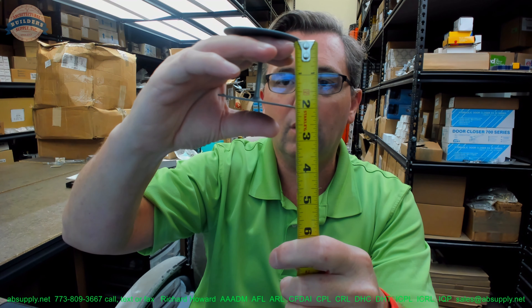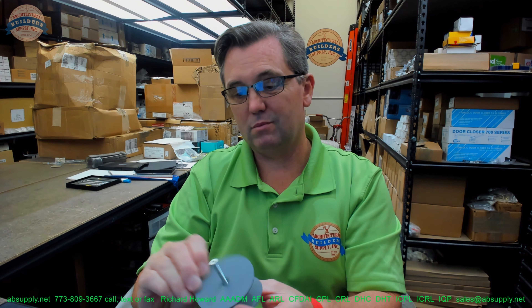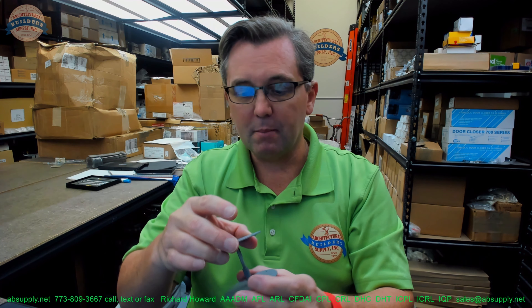This unit is going to be used to blank out a 2⅛ inch hole in a door. You don't want the hole there — just slap a filler plate onto it and that's it. You might also want the 336A edge filler as well, the 2¼ by 1⅛ edge filler. The other model is about 1⅛ inch and 3¼ on the diameter, just to blank out a 1½ inch deadbolt hole or maybe a 1¼ inch rim cylinder or mortise cylinder prep.